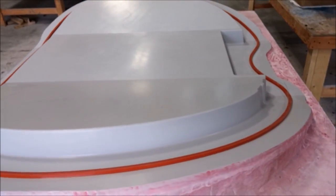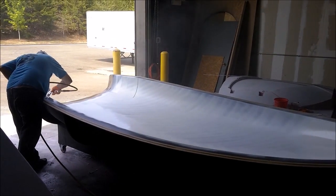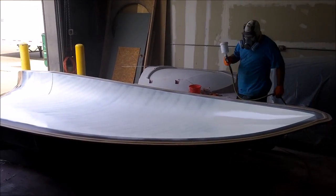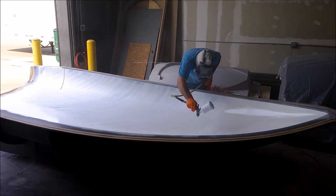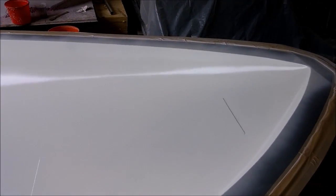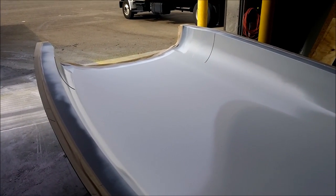Lastly, Jeff was spraying what is effectively the gel coat for the lower fuselage. This gives a much better finish for an outside part — you don't end up with the pinholes that are inherent with laying up carbon fiber. That's all sprayed up, so Monday we'll be laying up the lower fuselage. Once it comes out it'll have a white color, and of course it'll get sanded and painted later. Anyway, that's our update for this week — thanks for watching.